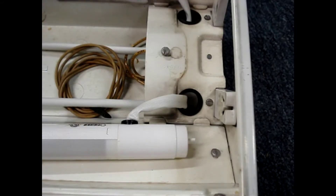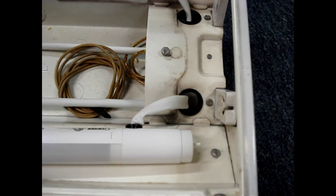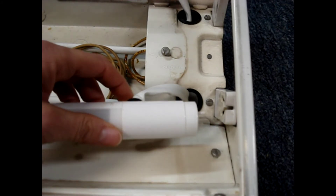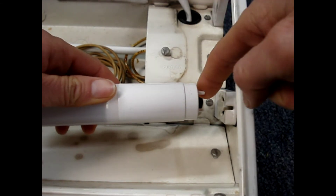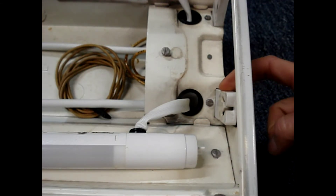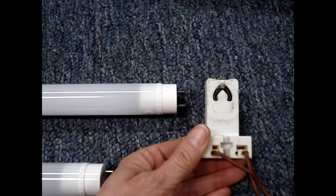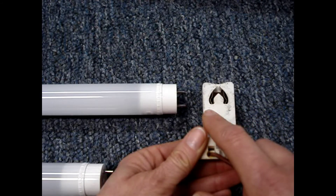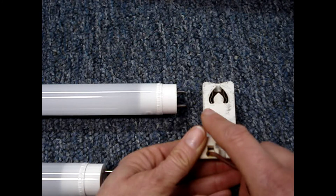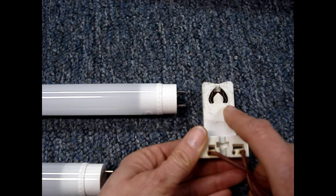I'll be buying more of these direct wire type LED replacement tubes, not only for the energy savings, but because the ends of the tubes are just plastic — there's no energy on them and the tombstone sockets are just holders. While researching which LED tubes to purchase, I found that some LED tubes had been recalled because of problems with the connections with the tombstone holders. Evidently, if the holders were worn out or damaged, there were some issues.